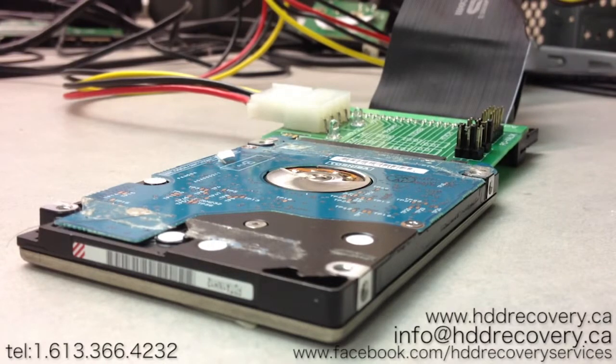So connect it directly to USB, hook it up to another machine, either a desktop or a laptop, and see if your drive starts spinning up. If it does spin, the problem we're discussing today is not related to your issue. What is related: if you're feeding power to your drive, you put your ear to it and you hear a buzzing sound on a Toshiba drive, that's what we're going to discuss.